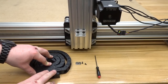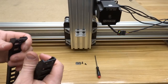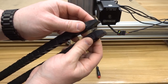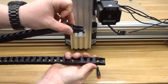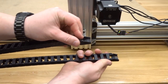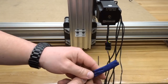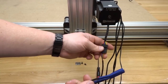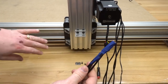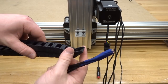Everything is prepped — double L brackets, single L bracket, slot cover with three-conductor wire all in place. Now feed wire through the drag chain. The Y-axis drag chain is at 1,000 millimeters. Unlike the X-axis, the end caps on the Y-axis drag chain are not mirroring each other — they're in the same position on both ends: one lays on the double L bracket, the other mounts to the single L bracket. Bundle the wires together with tape — include the X-axis motor and X-axis micro limit switch that ran through the slot cover. Y-axis micro limit switch is not included. Feed through the top of the drag chain.